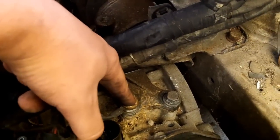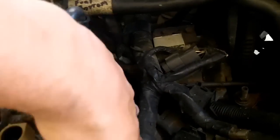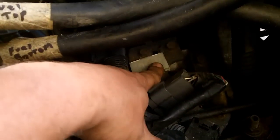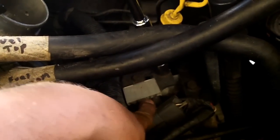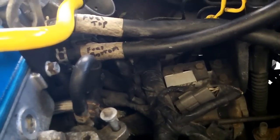There's one ground right here which is under the filter box and battery tray. The battery tray would sit right here, and there's actually one directly underneath the battery tray that pops off into this harness and then goes into the main harness that runs by the coolant rail. When you see something bolted to a bracket that goes nowhere, this is a common ground harness — all of these are probably grounds, grounded directly to the bracket. This is probably a MAF sensor ground or something like that.